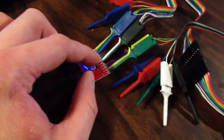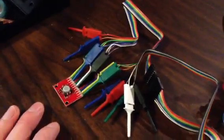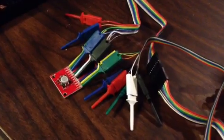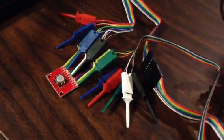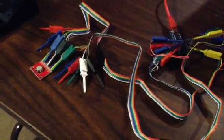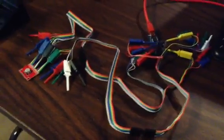It's kind of neat — it's interrupt driven. On Pin Change Interrupt; I found a library that allows it to do that. Not Hardware Interrupt, so it wouldn't be able to wake it from sleep. But at least for button presses and things like that, I've got some plans for this setup coming up a little bit later, and I'll post that.